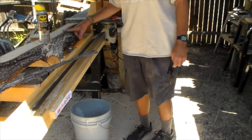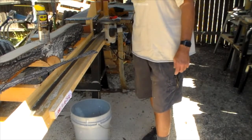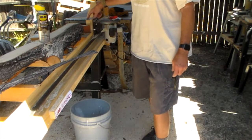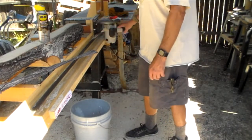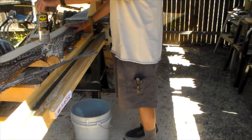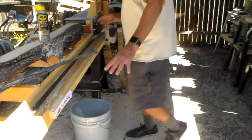And I think these blades, in the sharpening, you put a little less aggressive grind on them, which is what you want for ripping. So that helps. And this blade that's on here now is actually one that they ship with these Prozzy saws, a rip blade. Originally they just shipped with crosscut. So I think all those things combined got it to where it's working as the best it can for what it is. This race here to do that against, angle iron, getting the piece held down good and tight, lubricant, nice slow even speed, and the blade going with a rip sharpness, and I think that was it. And getting everything base solid.